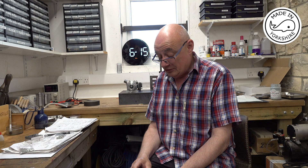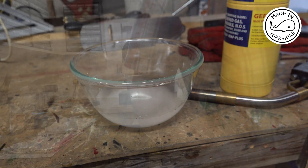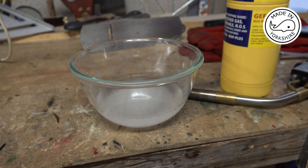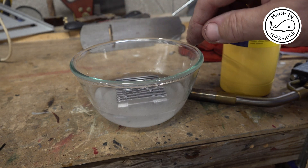I'd like to thank everybody for all the suggestions regarding how to remove a broken tap from this aluminium cylinder head. There must be about half a dozen different suggestions in total, but the most popular one seems to be to use alum, so I'm going to give that a try. I've put four tablespoons of alum in here, which is equivalent to 60 millilitres, and 100 millilitres of boiling water — mixed it up, but it's not all dissolved, so I've probably put too much alum in.